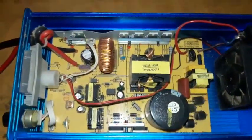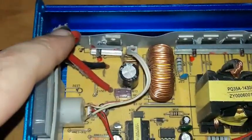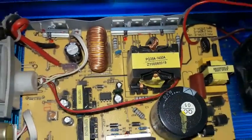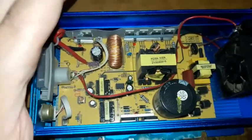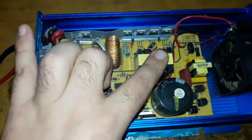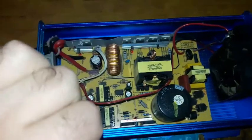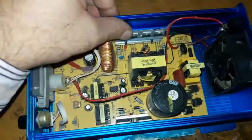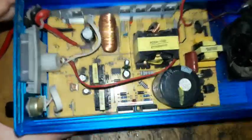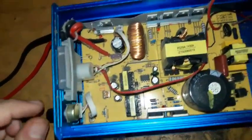This is the inside of the charger. If we zoom in you can see a lot of dirt — and this dirt is like soap and water to SMD surface mount parts. It is very similar to the 20 ampere black type, but it has a bigger transformer and more rectifier diodes. The 20 ampere has two diodes; this model has four — each side gives 40 ampere.